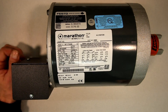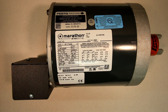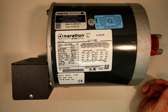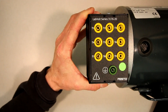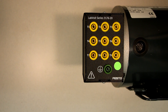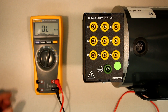In the previous video we went through the series and parallel connections for both low and high voltage. Again, everything is provided on the nameplate when you leave trade school, or it's on your phone within seconds of a Google search. What we need to do now is flip this over and take a look at the terminals. This is a nine-lead motor. We'll set up a meter and take ohmic readings on each terminal to determine whether this is a Y-wound or a delta-wound motor.